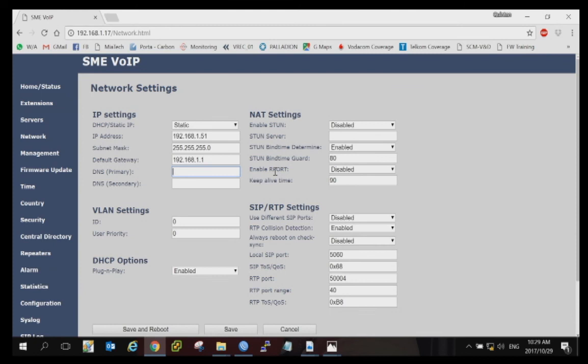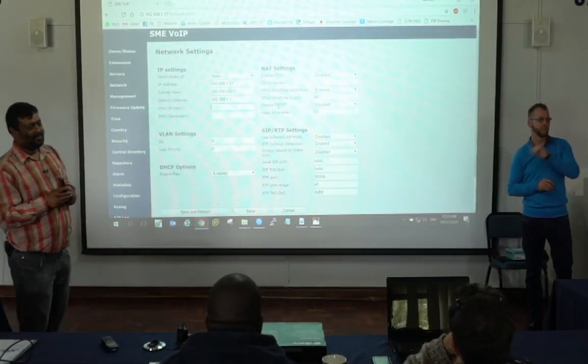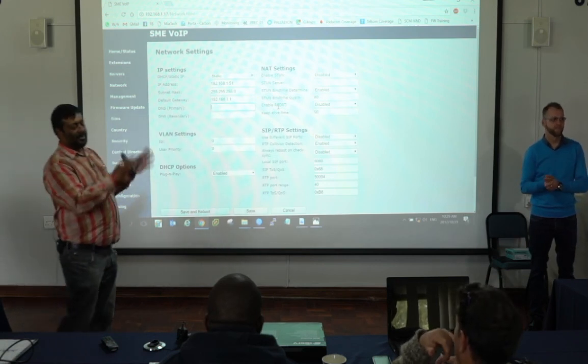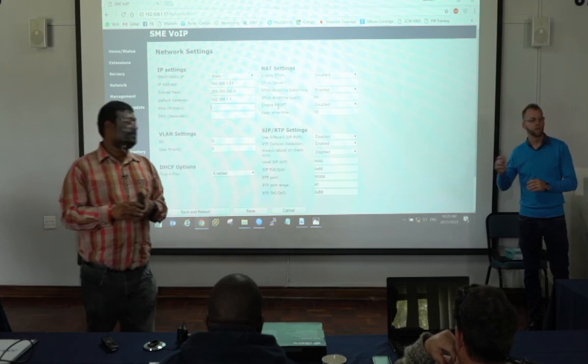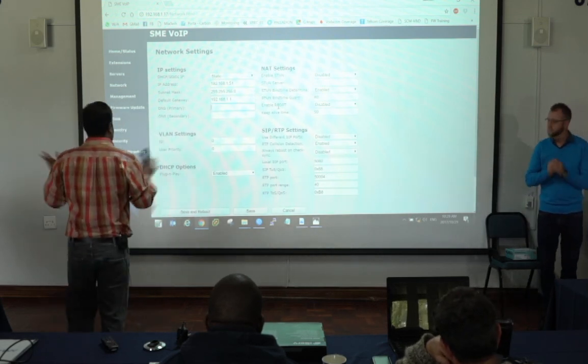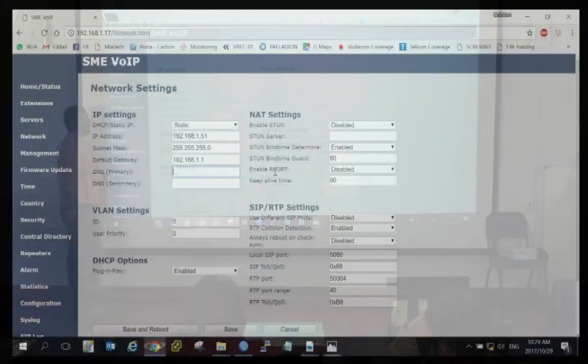Why did you all say no? He's going to the PBX. Because the PBX has a static IP address. No, you're sending it to a URL. We're not breaking out anywhere or anything. It's all local communications. So even if it's hosted or local, we don't do a DNS. Okay. That's all we need there. So we're going to save and reboot.